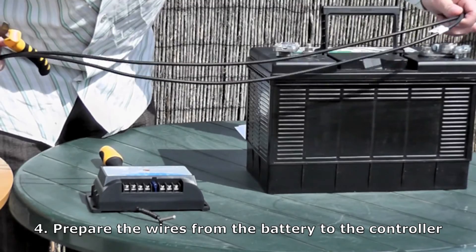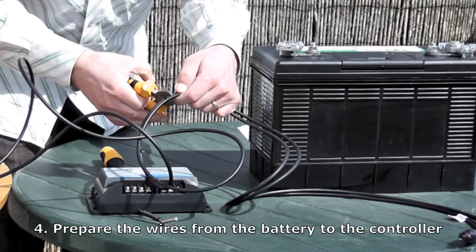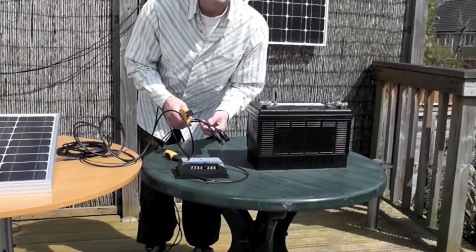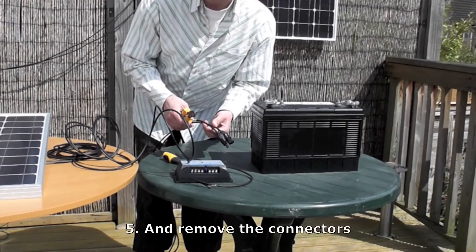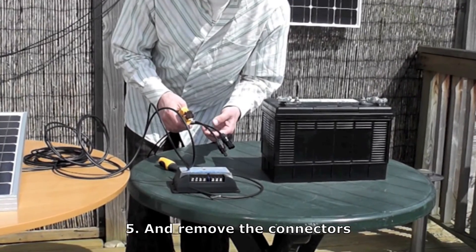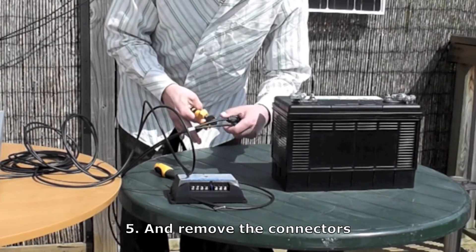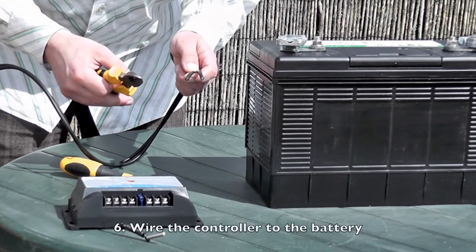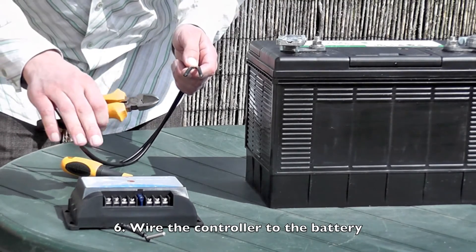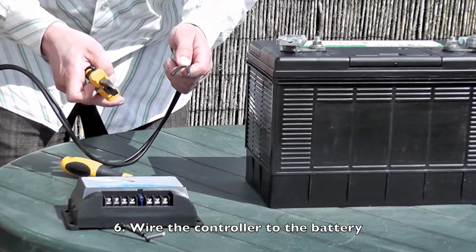It's useful to give yourself a little bit of extra here, so I'll cut them about here. You also want to cut these connectors off the ends of your leads — these connectors are normally designed for fitting multiple panels together like if they're on your roof, but for these circumstances we simply don't need them. Now you have to strip the ends of the wires so they'll be able to fit into the charge controller and onto the battery. It's best to strip about 1.5cm to fit them into the charge controller and about 2.5cm to fit them onto the battery.